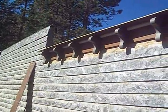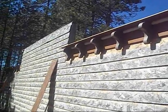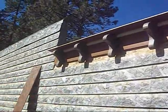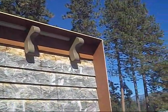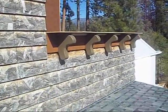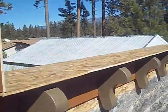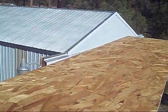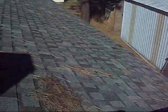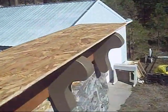Welcome back to the Twisting Knot Woodshop. Jeff came back this afternoon and we've got the corbel assemblies up and then we've got that top plate there that's going to create a ledge. You can see down here on this lower section, which is slightly shorter — it's about four foot. I'm six foot so I can give you an idea: the width is about fifteen and three quarters, and on this side where it meets the roof on that backside, it overhangs about two to two and a half inches.